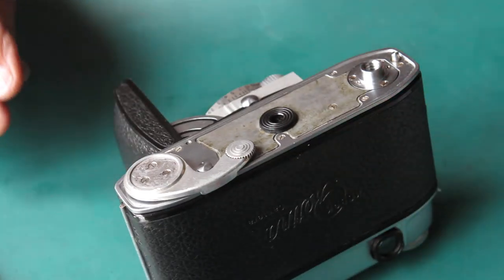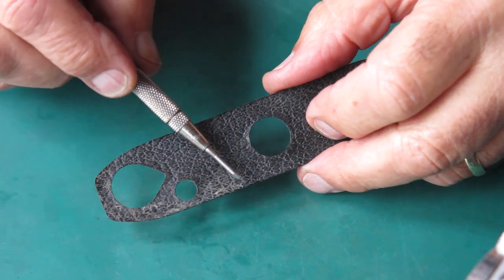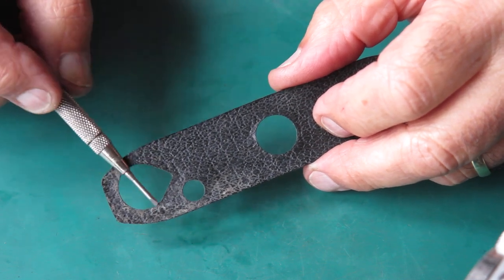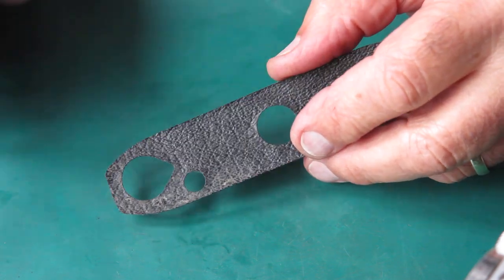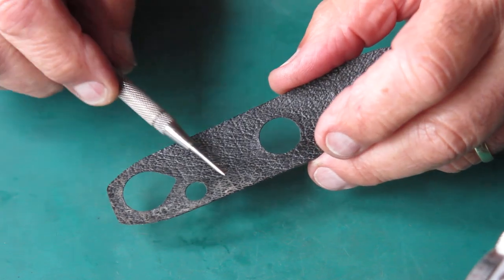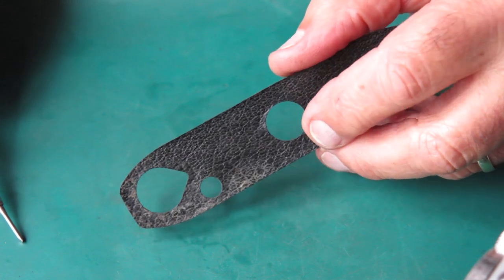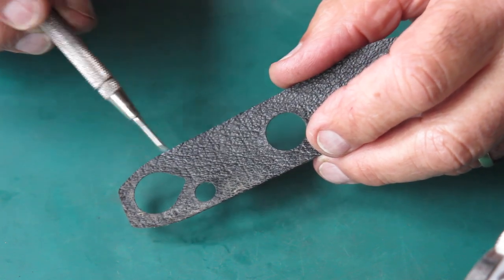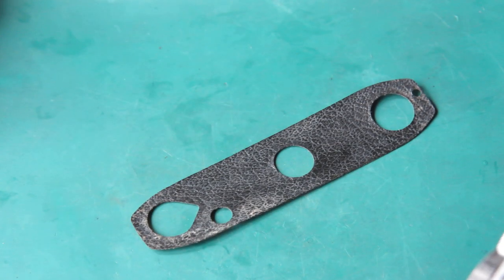At the base of the camera, I want the leatherette back. I have the leatherette here and as you can plainly see there's a very dirty patch here. I don't know what that is — I know it doesn't come off with naphtha, which probably means it's something water soluble. That's probably foodstuffs of some sort. So I'm going to have to try and clean this leatherette with some warm water and dish soap and see if I can get this filth out of it. It's sort of embedded into the surface. The other side is all clean and ready to glue back, so I'll be back when I've got that clean.